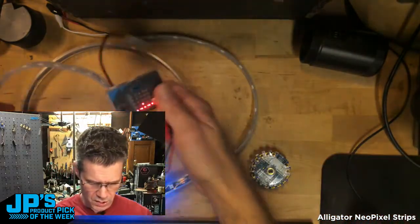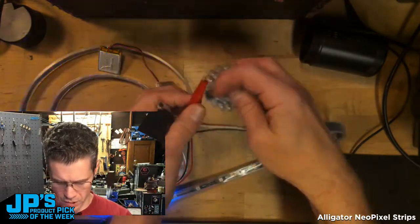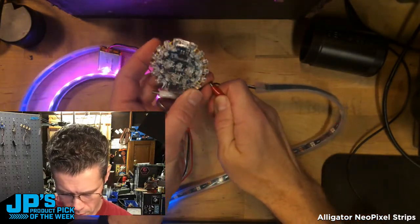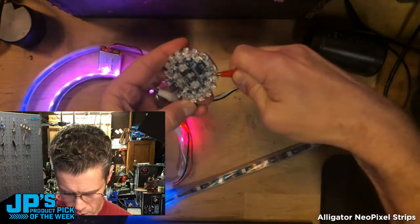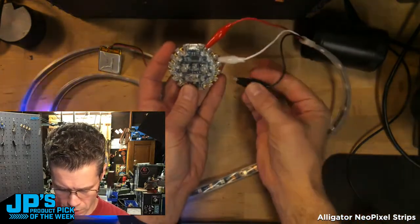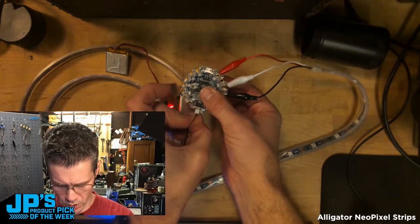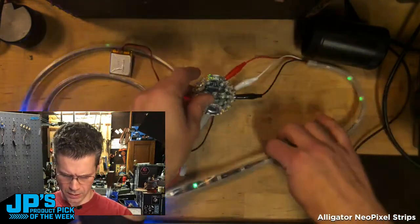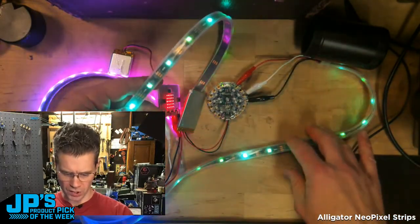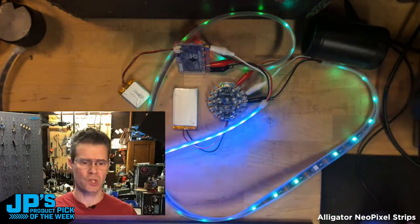We also have this longer one here. I'll go ahead and hook this one up to my Circuit Playground Express. So I've got power. Let's see, where's the top of the board here? 3 volt up here. I think I have pin A2 in my CircuitPython code, and ground. And I'll power that one also off of a LiPo. That'll work off a USB, it'll work off of batteries. And this one, I have one of our nice LED animation scripts running that does a nice little sparkle pulse there. So let's have a look at the web pages for these, since there's two of them.